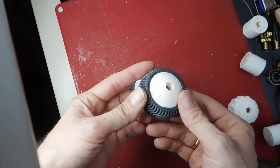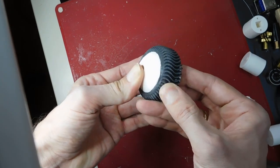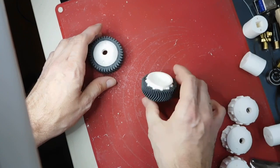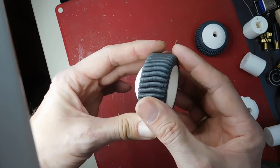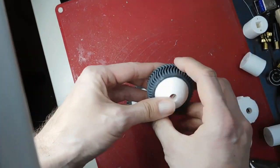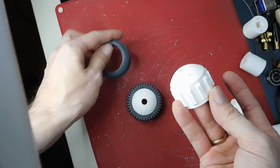I'm using the rubber mostly for stuff like tires, like here for the FPV car from MechaSpace Frankfurt. The material is a bit bouncy and it's rather soft, so it nicely adjusts to the surface the wheel is rolling on. I designed a mechanical interlock into the wheels so the rubber stays on while driving.